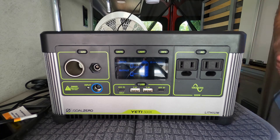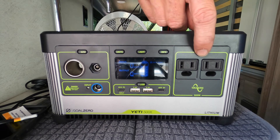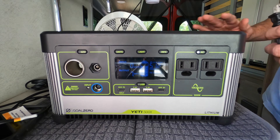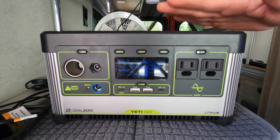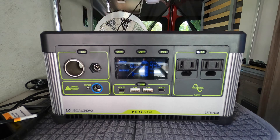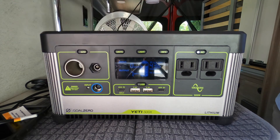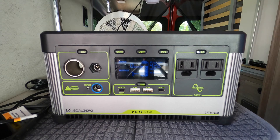This is what I was talking about earlier — my Makita batteries for my power tools, for my little portable chainsaw and whatnot. I always have to have those charged and ready to go. You'll notice here when we turn on this AC inverter, it automatically draws seven watts and I have nothing plugged up. That's just the wattage it takes to actually run the inverter. So tip — rule of thumb: if you're not using any of these stations, turn them off, because even the 12 volt, the LED, and the USB are going to draw a little bit of energy even though it's not registering on your output.